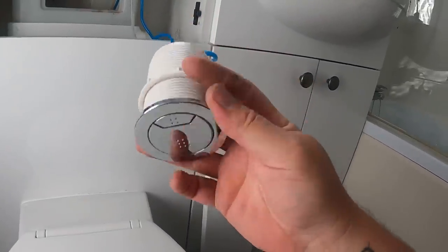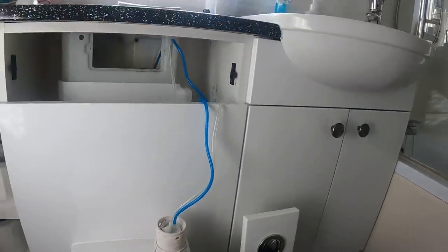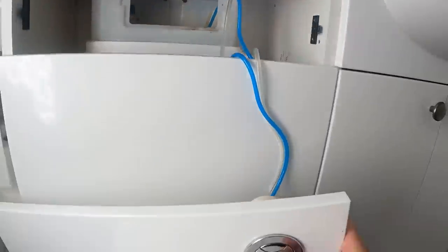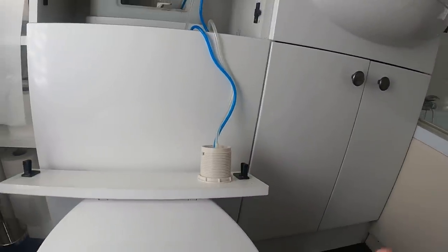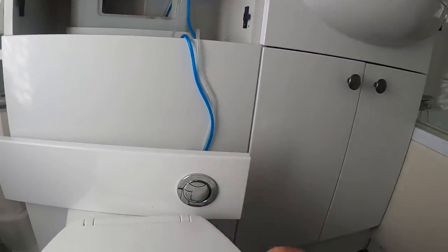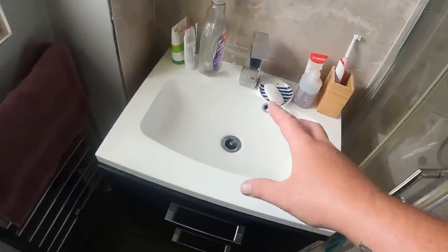I pull the hoses off and connect them to my little test button I keep in the van — if we press the bottom one to make sure it's the button and not the mechanism, give that a press and we get a full flush. That pops down after it's completely flushed, as opposed to the original button which was just flapping up and down and not even flushing the toilet. So we know the button is the issue. We can get a replacement button from Plum Base — I always keep a test one in the van so I know exactly what the issue is. Then we reconnect the original one just to confirm.